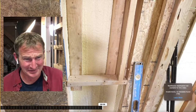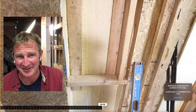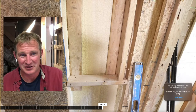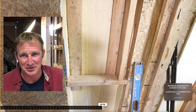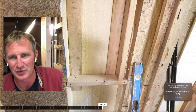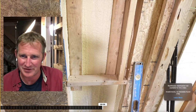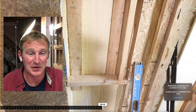And hey, even if you're an inch completely off, as far as much wider, you can always add in another piece of backer board. You already did all the waterproofing after this, so anything you put in there is just filler basically. Most tile or thin set manufacturers only want you to be 1/2 inch thick with their thin set. I've had some areas where I've had to do 3/4 inch worth of thin set. But if you do end up getting to that 1 inch mark, that's when I'll add in a piece of cement board, or maybe even sandwich in another piece of tile. It doesn't really matter, just as long as I can build that out to make it work.